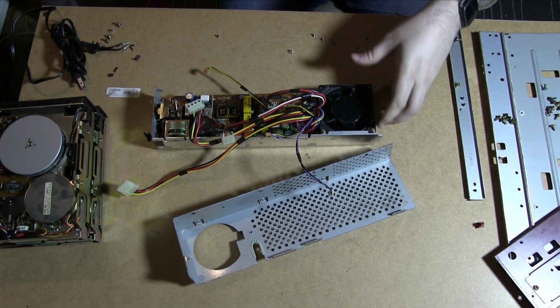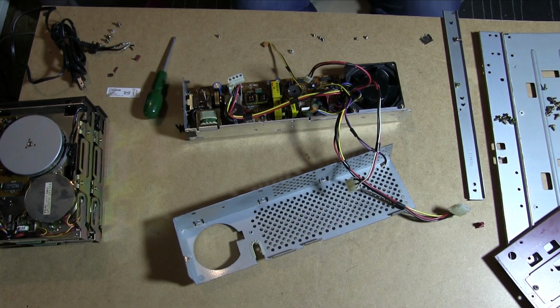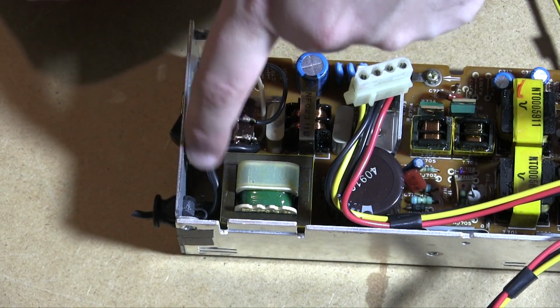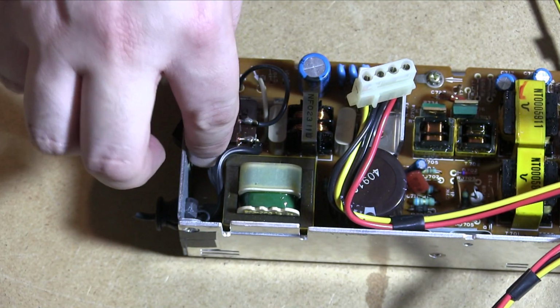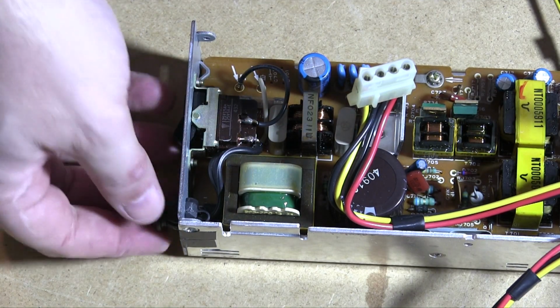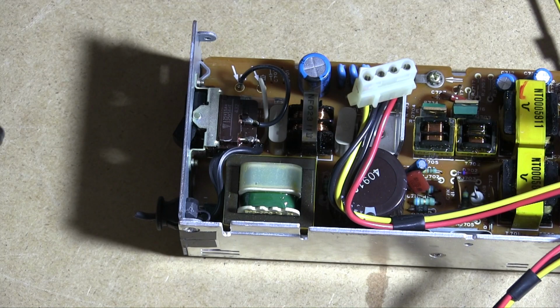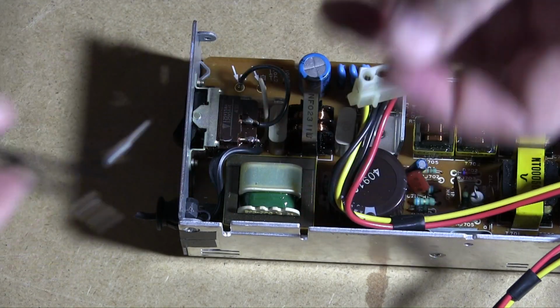What we need to do is... okay, so yeah, it's all soldered onto the plug, so let's zoom you in a bit. So here's our power lead, and it's soldered into the plug here, one for either side. So what we've got to do is desolder this, and then solder our cable into its place. It shouldn't matter which side it goes on, it's an AC connection. They've got one with a line going that side, we've got one with a line on this lead, so they just put them in the same place.